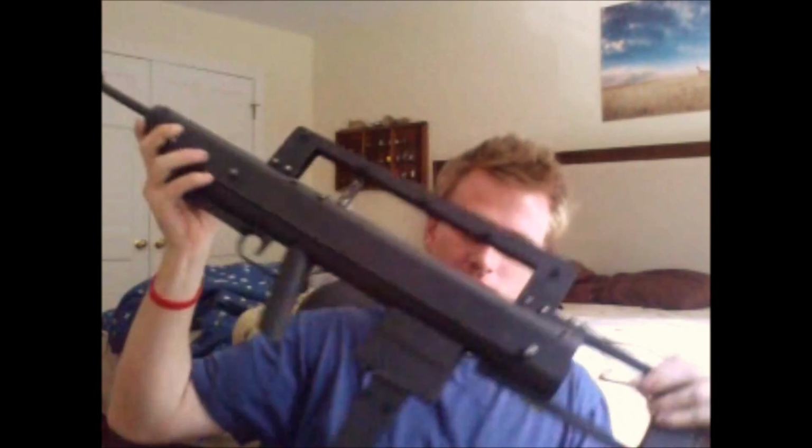It's an airsoft gun that I made recently. Took me about a month to make. Cost around $80. It's a Bullpup Design because the magazine is behind the trigger. And it's full aluminum. Got most of the metal at Home Depot and SpeedyMetals.com. It shoots at around 300 FPS, a .2 gram BB, and it's spring powered.